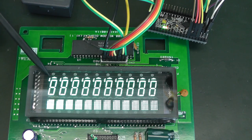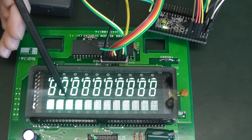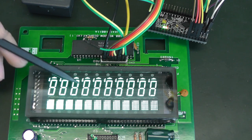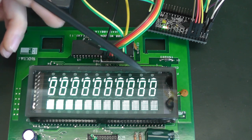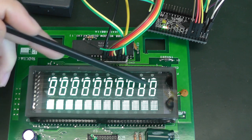Now, there are two interesting things to figure out: sometimes we disable whole parts, like the whole dot matrix or the whole digits, and sometimes we disable the same segment across all the same parts. The reason for that is because it's pretty hard to control every segment on every part individually, because then we would have too many pins. Here we have 7 segments plus 3 optional segments, so it's 10 segments for one digit. We have 10 digits, so we have 100 segments just. We would require 100 separate pins just for that.